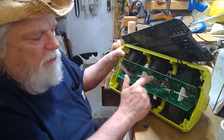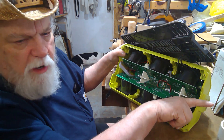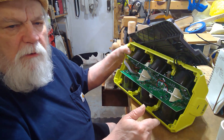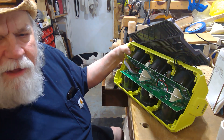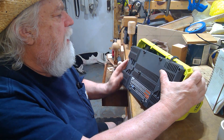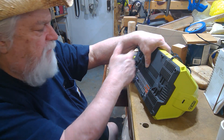On the other side he made a hard connection, running two wires through: he connected all the diodes to one wire as the positive, and the other wire he connected to the negative side of each battery. He brought them out the side and put an XT60 connector on there. That gives full access to whatever batteries are installed, with a parallel connection and diodes to prevent back-feeding.